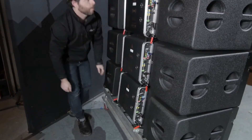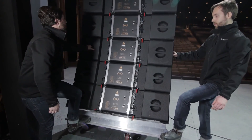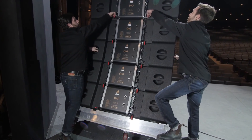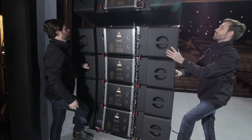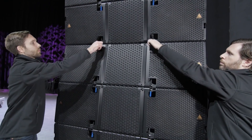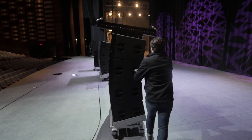At that point, simply release the four-stack from the enclosure above. If the array is highly curved, lower it until enough weight is taken to release the rear red levers from the enclosure above the four-stack — at which point only the front rigging pieces are connected. Raise the array with the front rigging still attached until the four-stack is resting on all four wheels, then release the front rigging with the blue levers. Continue this procedure until the entire array is on the ground on dollies.